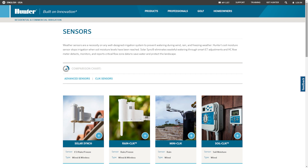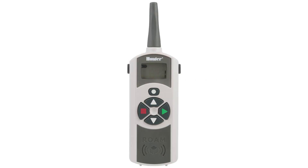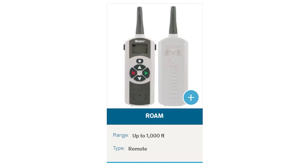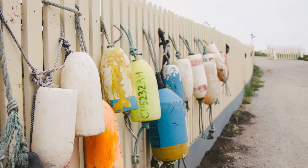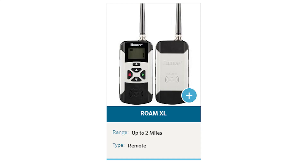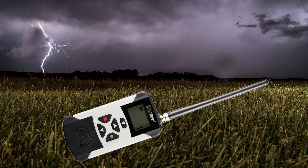Many of these Hunter timers have the ability to receive add-ons such as rain sensors and mini weather stations. They can also be operated remotely using these remote control kits. This is called the Roam — it is intended as a residential limited range remote. I haven't had good experience with this one; I've never been able to get it to work around corners or through fences, so be sure you can return it if you dare to purchase it. This is the one I use — it's the Roam XL kit. It has a stated two mile range under normal conditions and you can get it wet all day long without harming it. I wouldn't say that about the standard Roam.